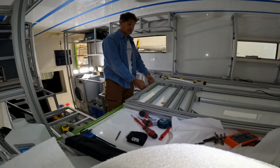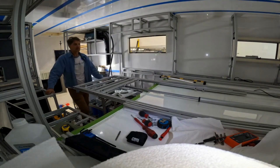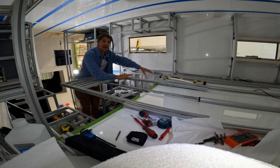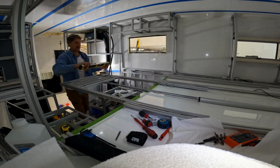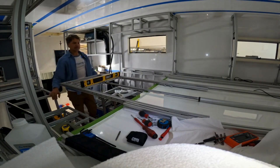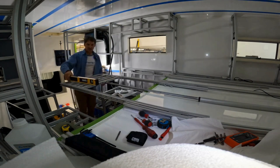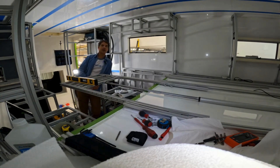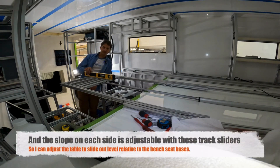This is pretty exciting — it's the first moment I have actually actuated this. I am dead serious. Being that this actuator is rated to about 150 pounds, both static and dynamic, it's important to get it right. Stop! Yay! That's good. Okay, give me my level. Let's just do a couple checks here. That should be listing ever so slightly that way — perfect, exactly in line with the camper. Let's check this way. Oh my God — guess how level this is. Zero. And that is without my top. This side is... zero point zero five degrees. Five one-hundredths of a degree of a slope. That's good enough.